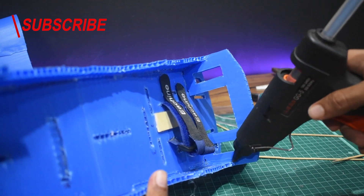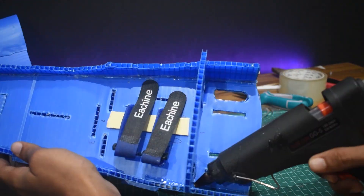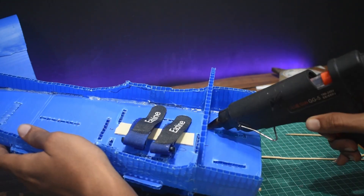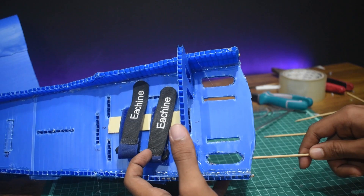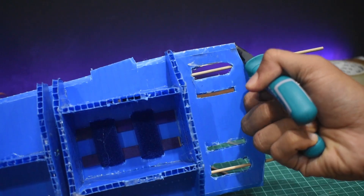I'm also going to reinforce the surface of these two pieces. This is something you have to do when working with kora sheet, since kora sheet is pretty much hollow — just adding glue inside the joint will not hold it in place. After that we are going to reinstall the barbecue skewers we removed earlier, just for some added strength.